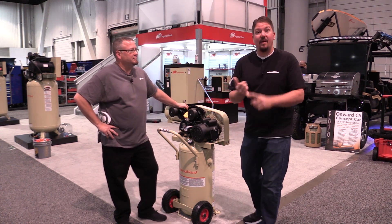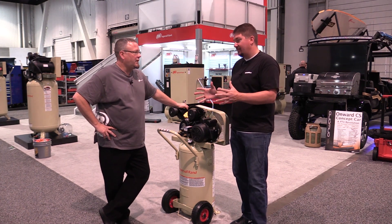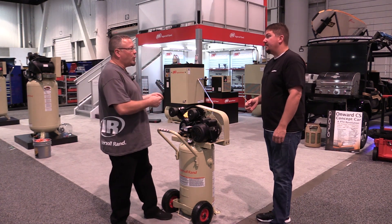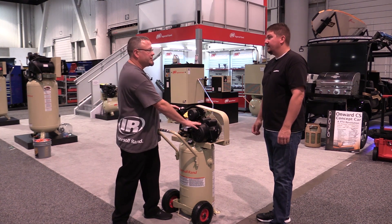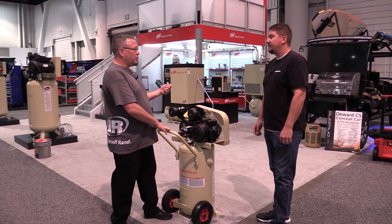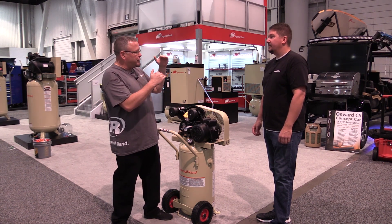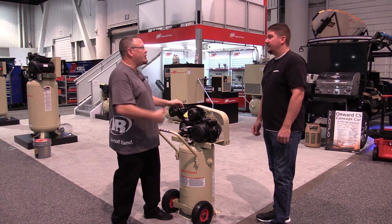So when you're out looking for an air compressor, look for something with good SCFM numbers. What's a good average, and what does this unit have? We give it two pressure ratings: 4.6 CFM at 135 PSI, which is the maximum pressure this machine can make, but if you use 90 PSI at your point of use — which is what most tools operate at — it puts out 5.2 CFM. The higher the pressure you go, the lower the flow; but if you're using lower pressure at point of use, it'll actually put out more flow.